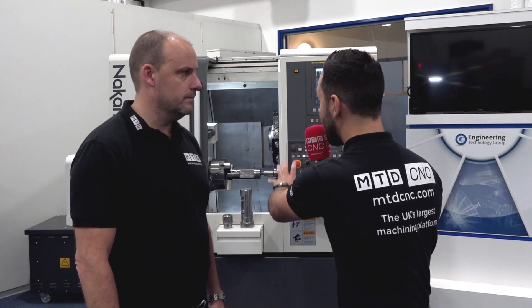And not just turn parts with deep depth of cut — exotic materials, hard materials, any materials you can cut on this machine — but you can also mill great features on this machine with a plus and minus 41mm stroke on the Y-axis.